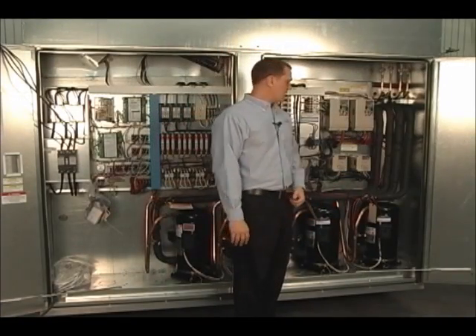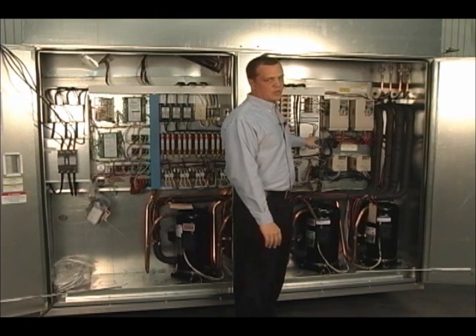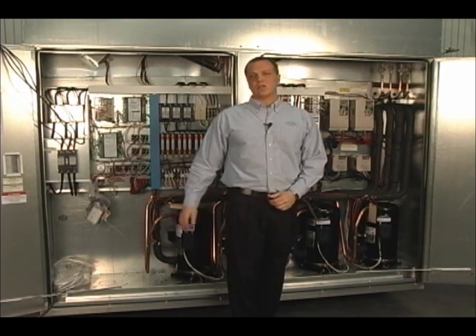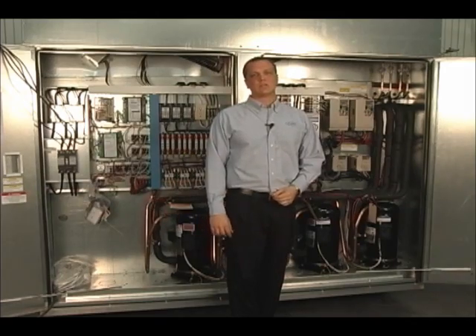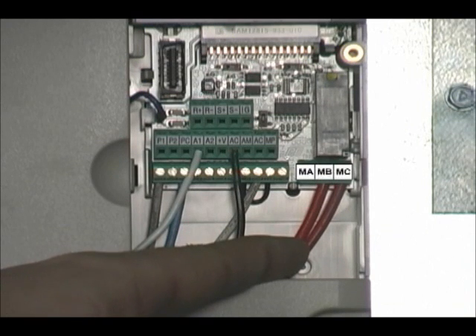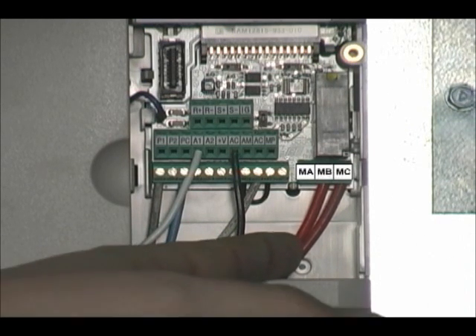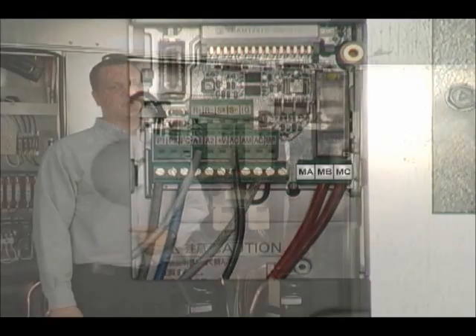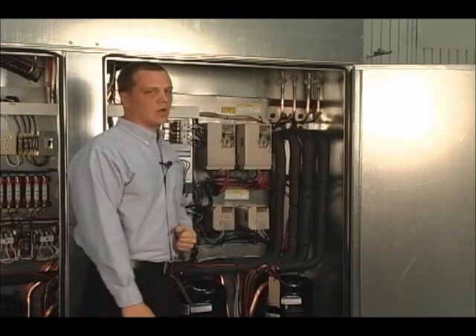This is designed so that if a safety event occurs within the unit — either the PBO or smoke detector — it will kill the 24 volts AC to the unit. The two red wires, MC and MB, are tied in with our PBO (phase brownout protection) or a smoke detector. This depends on what has been ordered for the unit, as these are options.